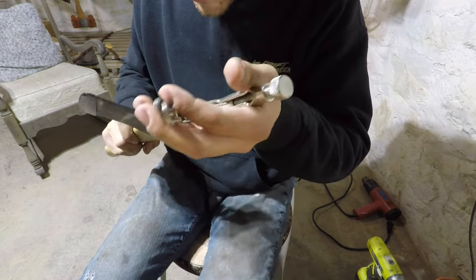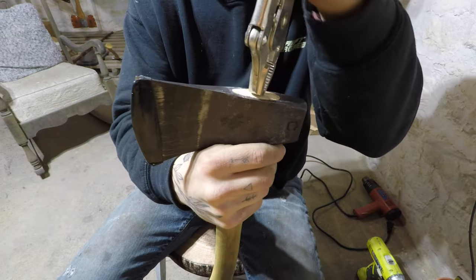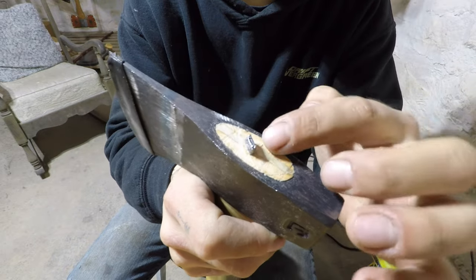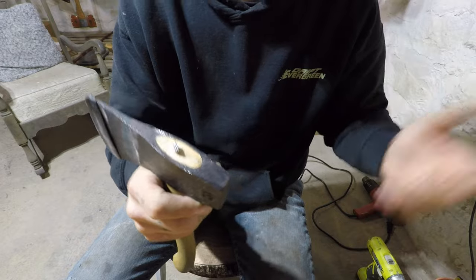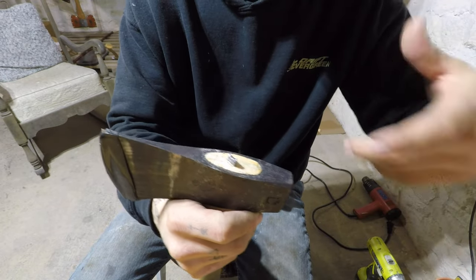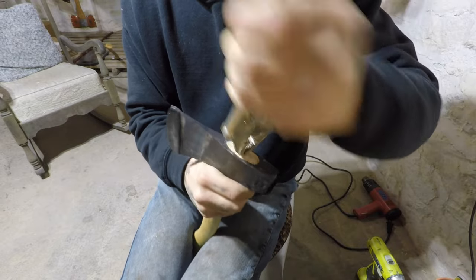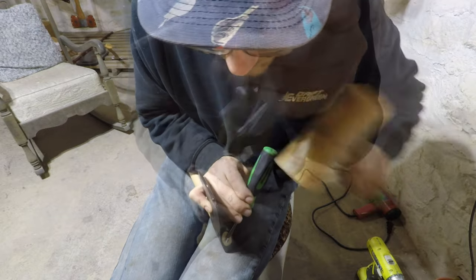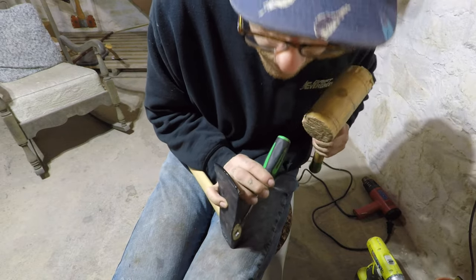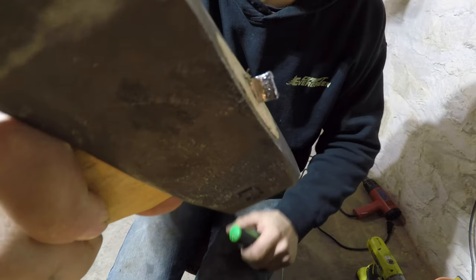You can rock the wedge back and forth to loosen it up. What you don't want to do is rock it back and forth the wrong way — if you rock it that way you're going to end up snapping that steel wedge off in the head, and then we're flush with the top of the eye and stuck trying to pry it out of there. Rock it the correct direction — it'll take a minute or two but you're just loosening this step wedge out. Council Tool tends to use the longer ones. We're starting to get some movement out of that wedge; you can see the gap there.